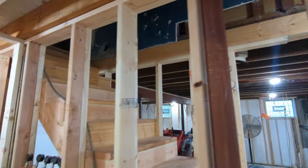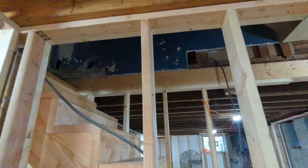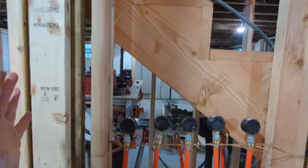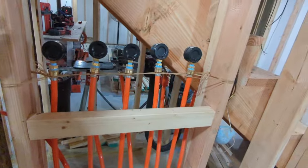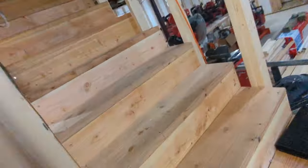But that's kind of, the beam is oftentimes a natural place to put the raceway. But then once we're into the bathroom wall, we can drop into the wall, and then we can swing this corner up in this area here. If we come back down, you're going to run into problem C getting past this post, although we could come through. That really isn't ideal. So we might take the long route.